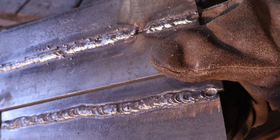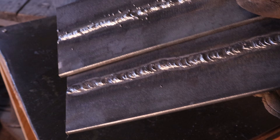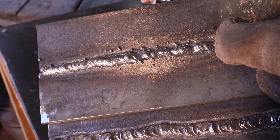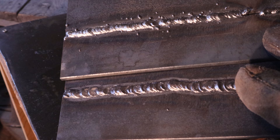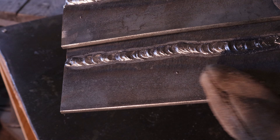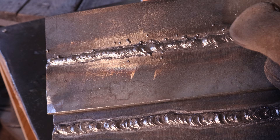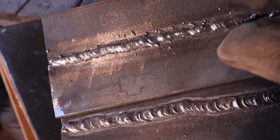I hope this helped you decide on which electrode you should go with. Although the 6011 has a higher deposition rate, the 6013 is easier to control and not as likely to burn through the steel as the 6011. If you're welding thicker material, you could start by grinding a groove where your weld is going to be, running a 6011 rod to get further penetration in the steel, and then covering that weld with a 6013 so you're using basically the same metal but able to build up more of a weld with the 6013.